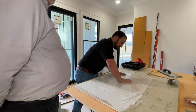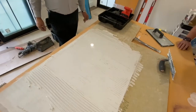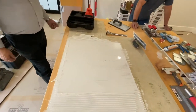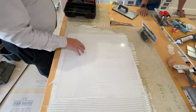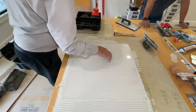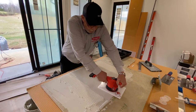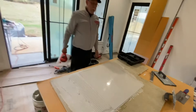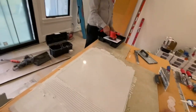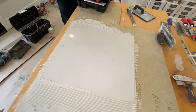We're going to take it, move it, fold the ridges over. What percent coverage would you say we've got there, John? I'd say it's higher than what we had with the half inch by half inch — this is probably 75 to 80 percent. You can see this area here is almost 100 percent coverage. Now you can see we've got a lot better coverage by using this Montolit Batile Pro — that right there is about 95 percent coverage.